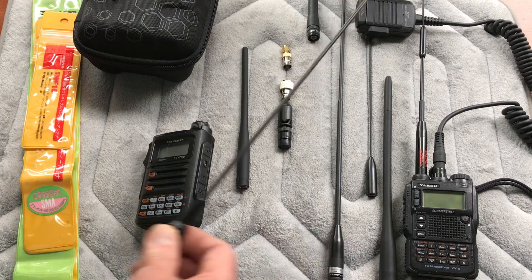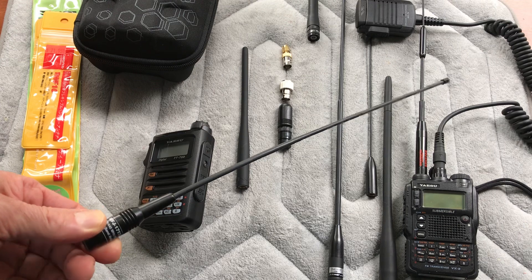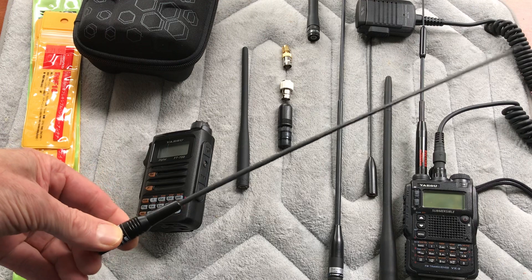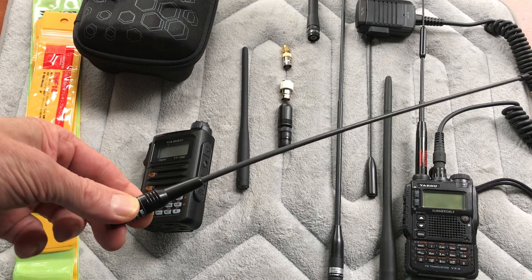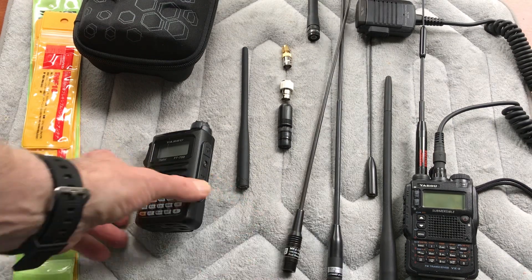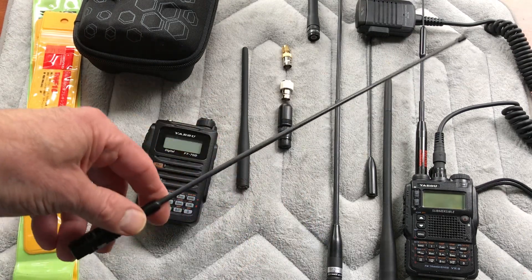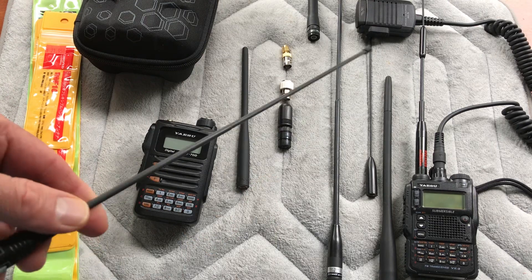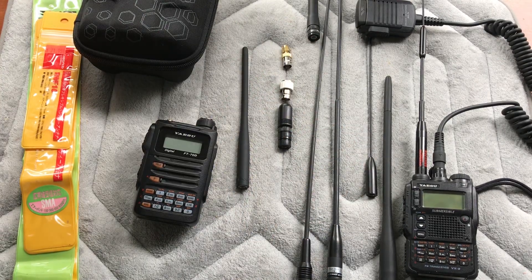When you jump up to something like this — a full quarter-wave two-meter vertical, like you'd find on your mobile radio — the radiating element is going to be about this size. This is unity gain. The advertised wattage on these radios, say five watts, is going to put out the full five watts into something like this — minus some SWR if it gets high at either end of the band, but that's typical. Unity gain means no gain — it's just going to match your wattage rating.